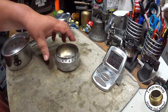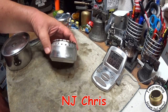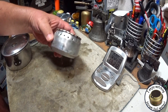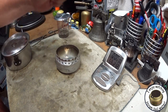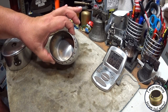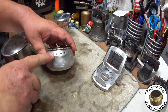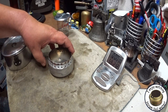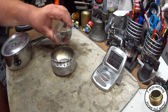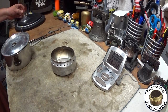Hi, Hiram here. I got a stove from NJ Chris — it's a side burner type alcohol stove. He asked me if I would try one of my tests on it, so that's what I'm doing today. This is a super-sized one out of a larger beer can. It's about three and a third inches in diameter, two inches tall, has 22 holes about a half inch down from the top, about 95 thousandths in size. I'm going to try this with one fluid ounce of methanol. It's a big burner, so it's for a big pot.